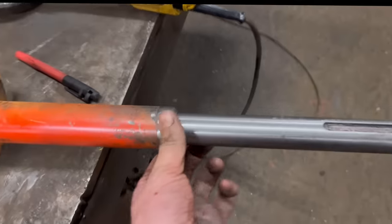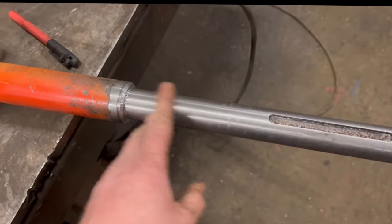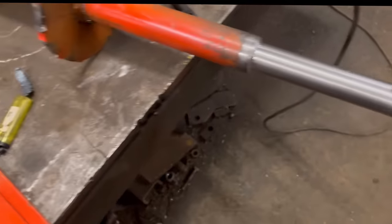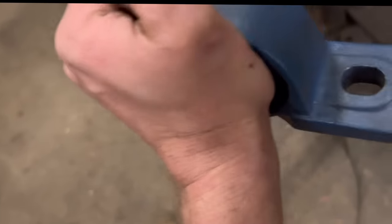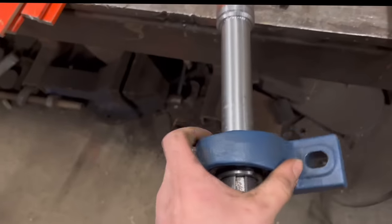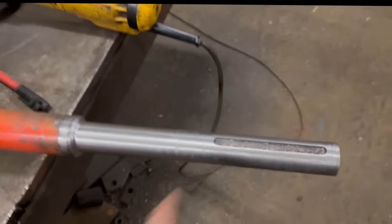So I've got that end machined down. It was pretty horrible to do because it was chattery, but I've smoothed it off with emery tape and it's all right now, it's good. So that fits on there nice. So that keyway needs extending now.